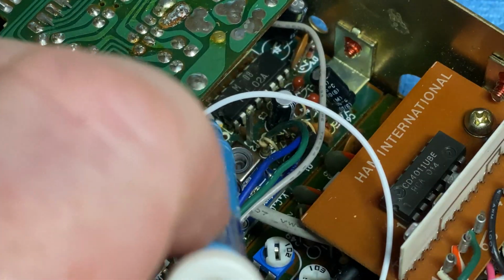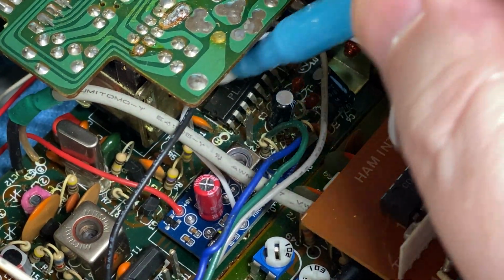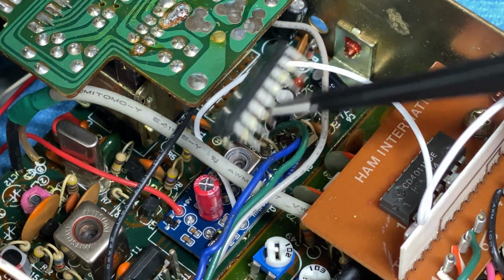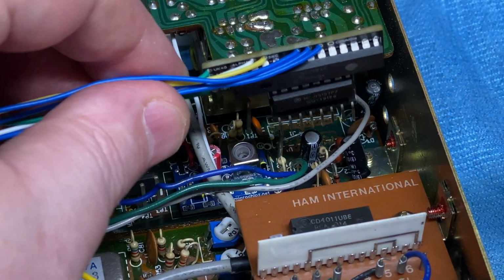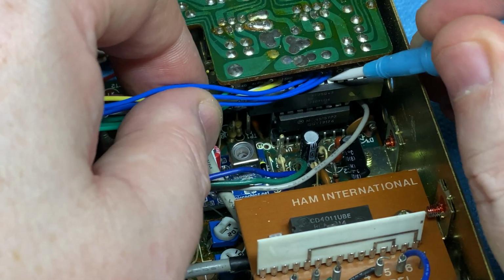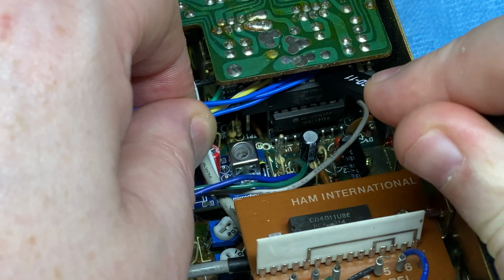And now we'll take out my temporary PLL chip, because we know the radio works now. We'll do the rest of the FM audio modification in a moment, which is that white wire that's flapping about in the breeze. So we'll take out the PLL02A and we'll fit my mod board in its place. So with a little bit of persuasion, in it goes. Just making sure it doesn't touch the back of the channel change, because that'd be bad.